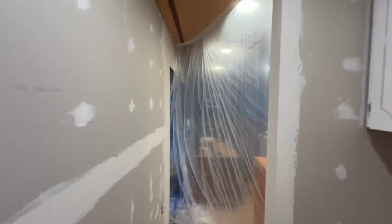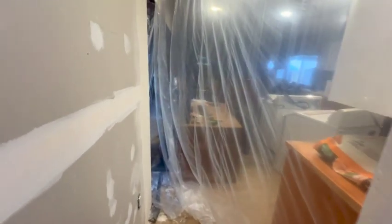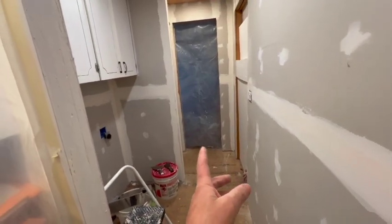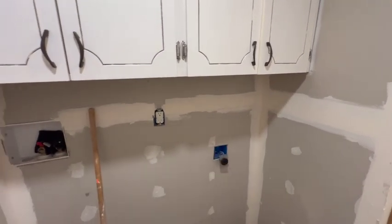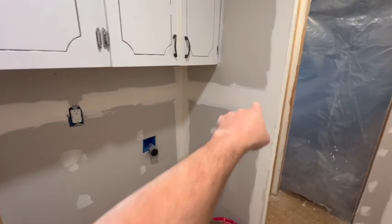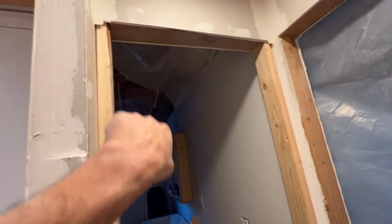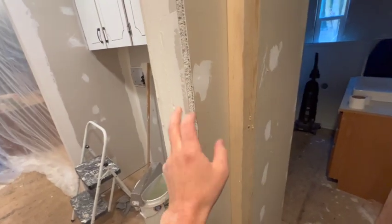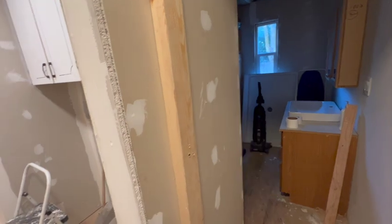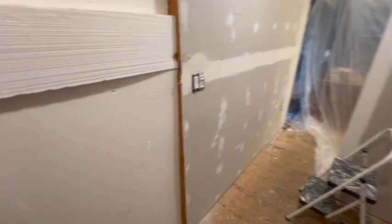All right, so we got one more biohazard containment bubble going on here. We're coming on the end run of the drywall finishing. The bump out there, kitchen, living room, and the front bedroom's up there. Coming back in here to the hallway to the master bedroom and the laundry nook. So last night I put the tape up here, mudded in some tape here and here. I think this one was already there. This one was already here and up here. And since I just recently put in this little door jamb here, I put some tapes up there on both sides. I'm missing one corner bead here, which I'll get tomorrow, and one here, and then I have to do some drywalling back in the bathroom, but I think we're just going to finish it up to this point for now, and then worry about the bathroom some decades from now when I get to that.